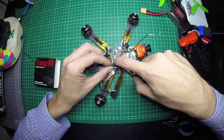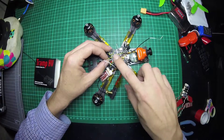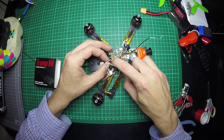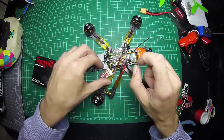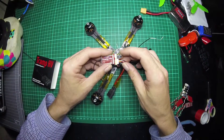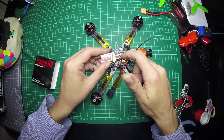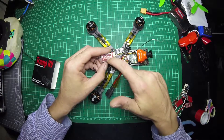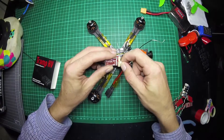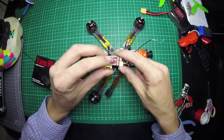I've chosen UART3, so I'll simply go into Betaflight configurator, go to the peripherals tab or drop down in the ports tab and choose Tramp HV. Not Tramp Smart Audio — getting them mixed up. In the drop down box you'll have Smart Audio TBS and Tramp — I can't remember what the exact name of it is — but you'll have the option for the Tramp telemetry.